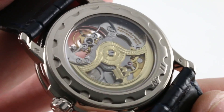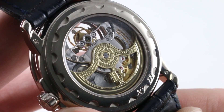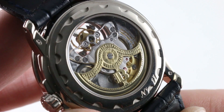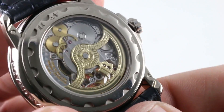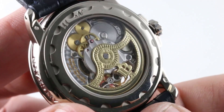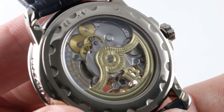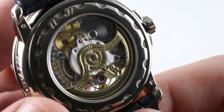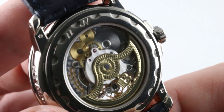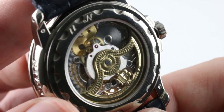On the reverse side, the watch is just as engaging. Perhaps unexpected is the automatic winding mechanism — less expected still, automatic winding with a hand-skeletonized and freehand-engraved gold rotor, beautifully executed. As is the rest of caliber 25: while most of the business end is on the dial side, there's still a good deal of handsome finish — a combination of perlage across the plate, Côtes de Genève across the bridges, and graining across the wheels. All screws are black-polished with chamfered slots, and the movement is adjusted in five positions, which is chronometer grade.